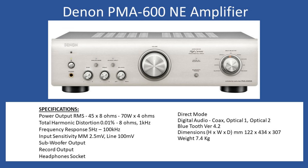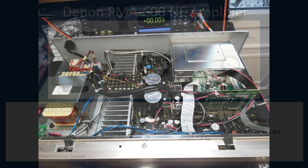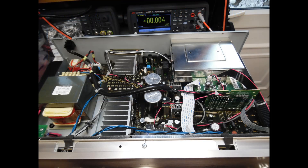So what was the issue when this amplifier came into the workshop? This amplifier isn't that old. What was found was that if you had it connected to speakers or headphones and left it running for maybe a couple of minutes — probably less — there was a very loud crackling, almost like a loud static noise, coming through on the left channel. Even adjusting the volume control didn't make much impact. However, if you pressed the direct mode — effectively bypassing the tone control circuit — there was no noise at all. That told us the issue was emanating from the tone control board.